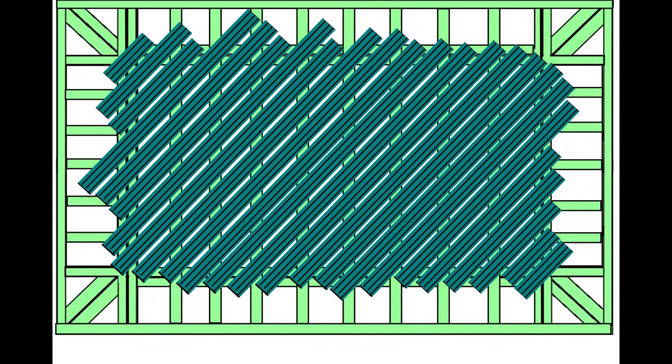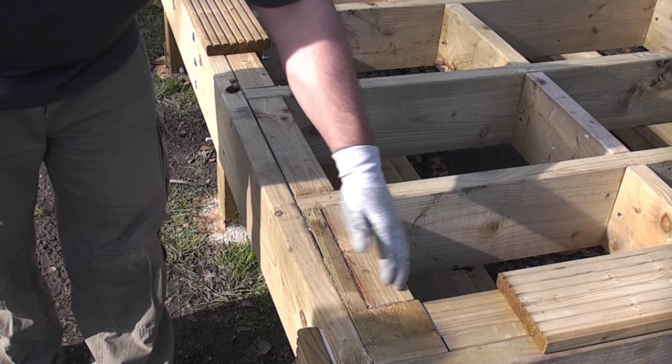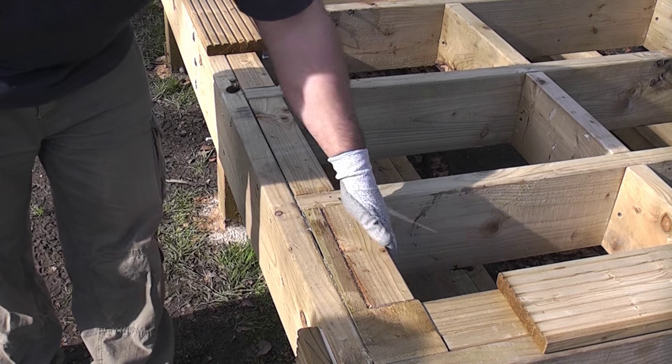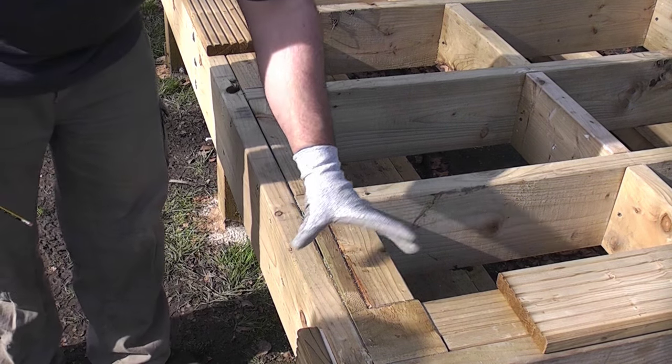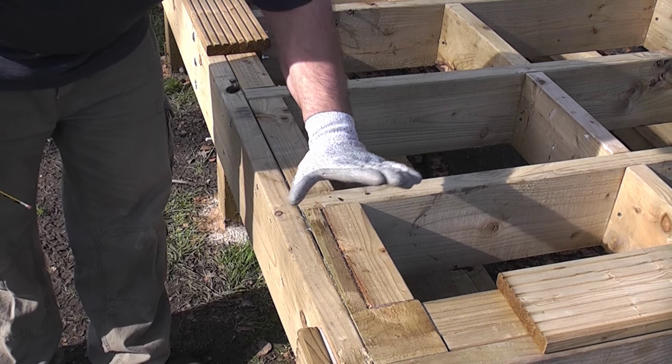This is one example of how you could position the joists for a picture frame deck. You can install the boards in any direction, even diagonally, as long as you plan the joists correctly. Because this is being picture framed we need to ensure that there is support alongside the joists to enable handrail fixing at a later date and also to support the ends of the decking boards.